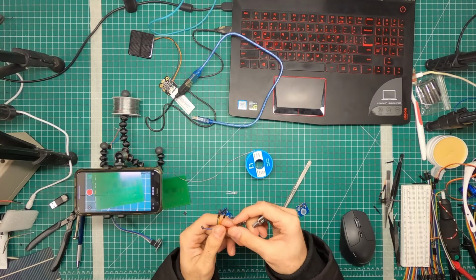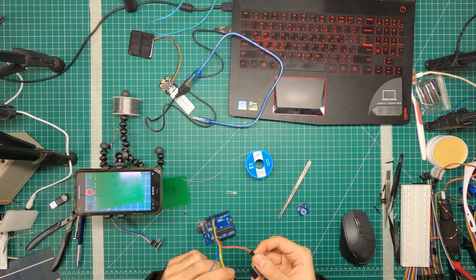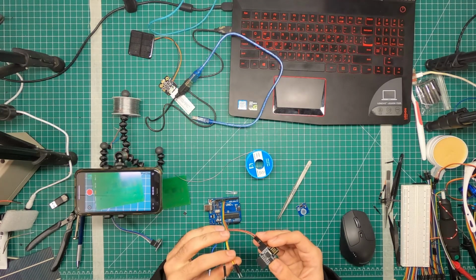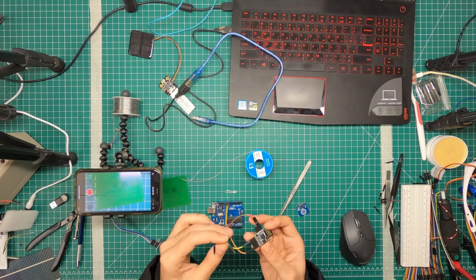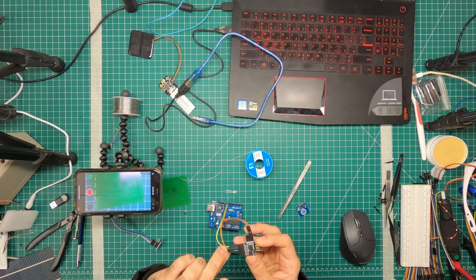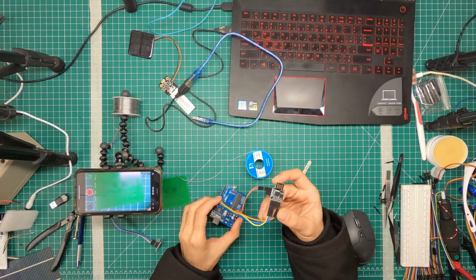And on here, you want first positive and negative. You want 5 volt and ground. As you can see, we have the power pins, 5 volt and ground. And here you want PB0, 1, 2, and 3. I think that's the one. No. So you want PB5 connected to 10, which is orange. And then 0, 1, and 2: 0 is yellow, 1 is green. I'll attach the image that I'm following. 2 is blue. Blue is PB2. Perfect. So that's the wiring diagram, or the wiring hookup.